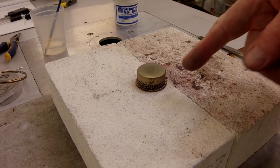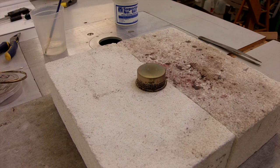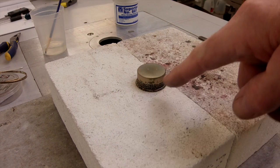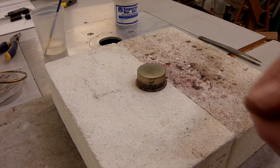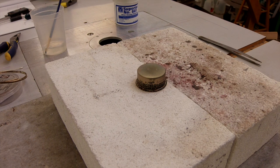To clean this off: once the silver braze filler has hardened up you can actually toss them into some cold water and that will help scrub them clean. But basically I let them cool off and then I throw them in a little container and boil them. The boiling water will take a lot of the flux off — that black that you see. And what it doesn't take off, you can put on some rubber gloves and use a wire brush to clean those.